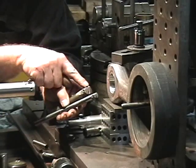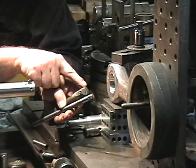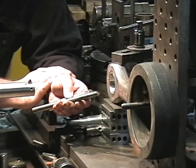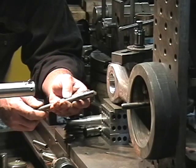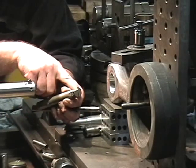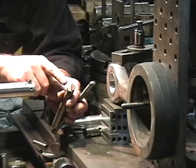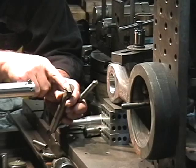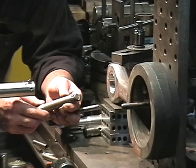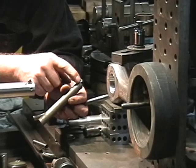Don't fool with the top of the tool. People get that and they'll grind down a little bit trying to put that tool on center and give it more relief — that's really not the way to use an EverReady style tool. It's better to look at the stock grind, and then you just give it like a ten degree clearance on the back side, radius the front. As the tool is built, the clearance is already built into it, so unless you're thinning a chip, there's no reason to do anything but grind this side of the tool bit.